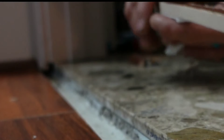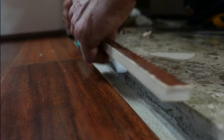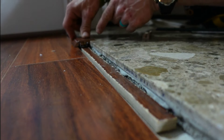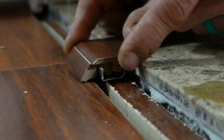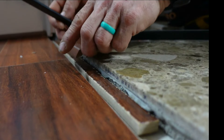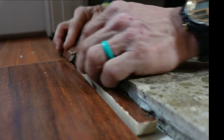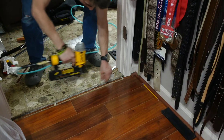That's where these things come in — these little strips I cut. I set these inside here and they allow me to still have a quarter of an inch expansion gap. Let's see how it builds the floor up level there. Now my metal track — even still, we're a little bit low. So this thing they sent out right here can be used as a spacer and it slides up underneath there. As you can see when you clip it down inside there, now you have the adequate spacing that you need. So that's what we're going to be doing.